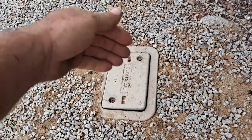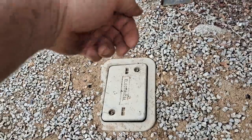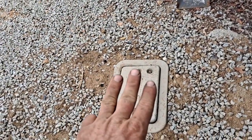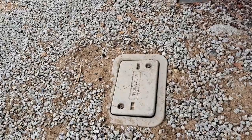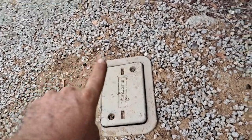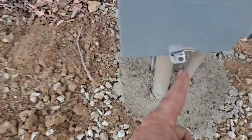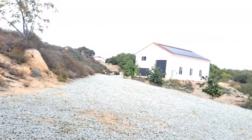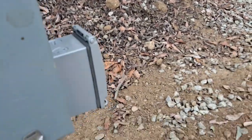When I did that, I basically brought the wires in, cut them, brought the wires out, and I put in a 3 connector Polaris. So that way I could tap a third one on, ran another conduit under, and punched in that same size wire to here. So that size wire was for 100 amp service out there, and it was way overkill.